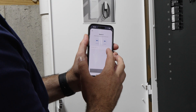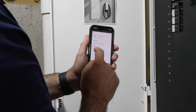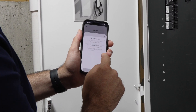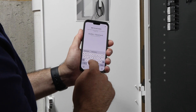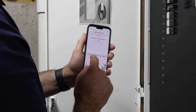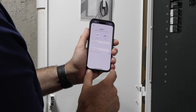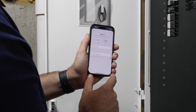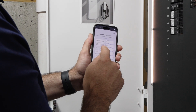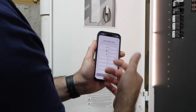We'll go to our next breaker — this one is a standard breaker, rating of 20 amps, located in the basement. Under outlets, we're going to specifically label it for the AV rack. Hit save, and then you'll see everything we've put in saves as a custom label. When you're in the application down the line, you'll actually see exactly what we typed in.